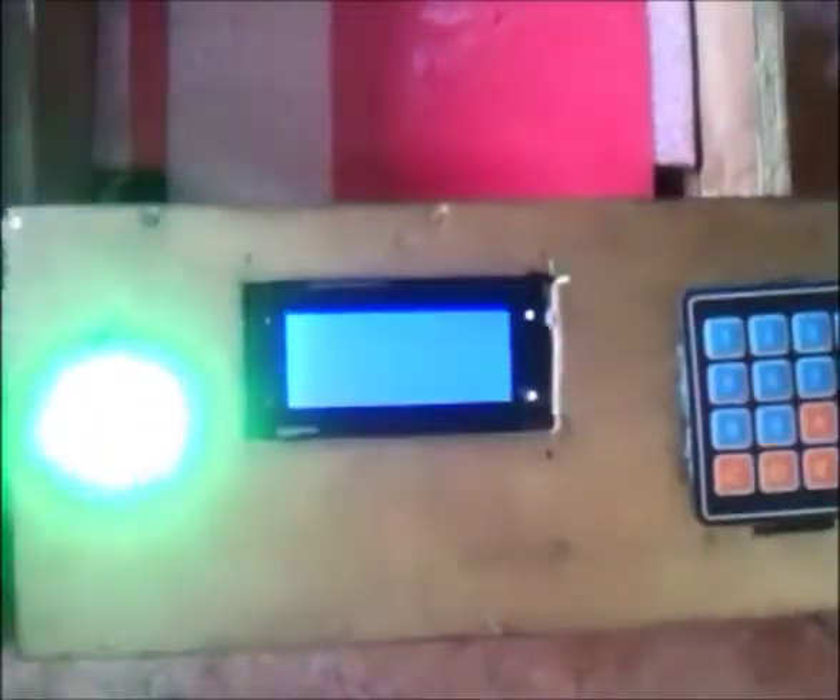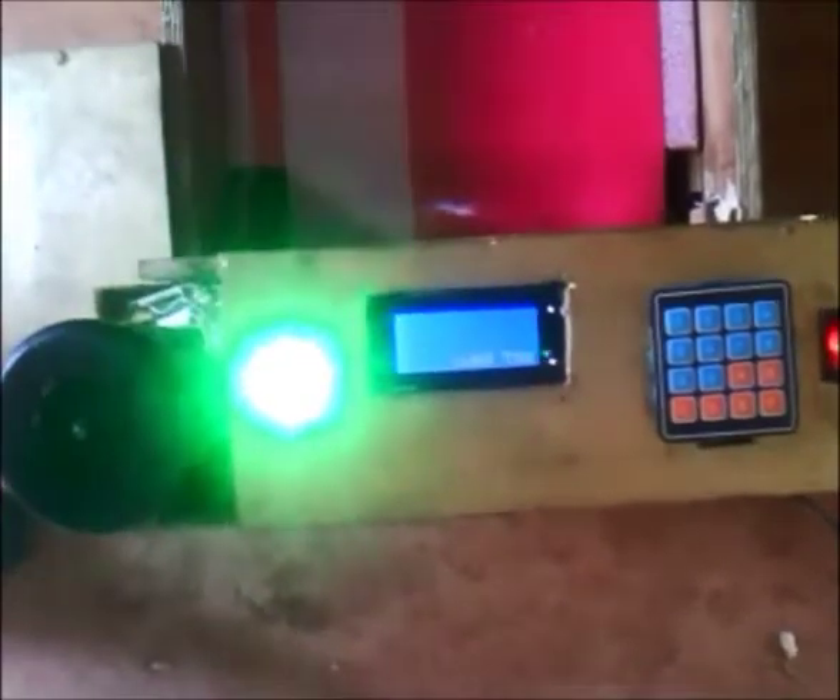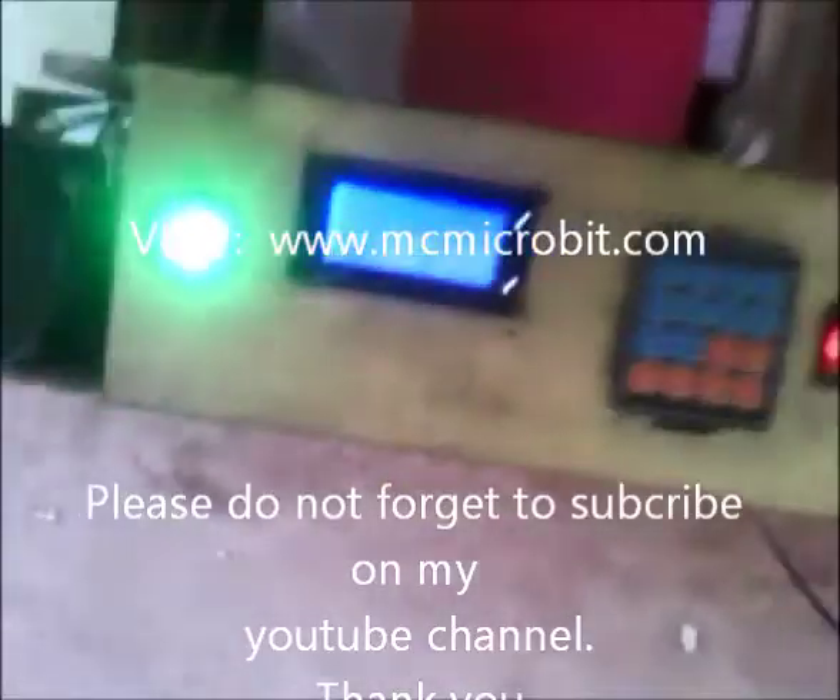What would the error look like? Let's assume that this window was not in place when you started the system. Remember, I showed you this knob, which is meant to check the system when it is about to start functioning. During system check, the system is meant to detect that it is not working and it will start blinking. That blinking means there is an error. If you check the LCD, it says 'roll empty' — because the roll is not in place. All you have to do is put the roll in place, set the system, and it tells you: 'welcome', 'system check', 'system ready'. This is just one of the errors that you can easily track; the rest are also integrated in the system.